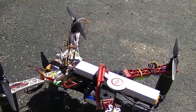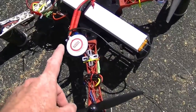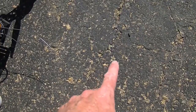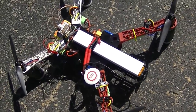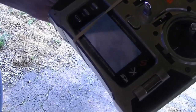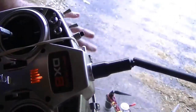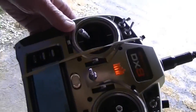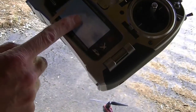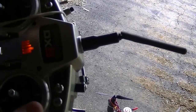The antenna is mounted underneath - that was another suggestion - and that seems to work pretty good. We've got eight satellites. In closing, I tried moving the GPS way out, a couple of feet away from the antenna, and it didn't seem to help. The radio is on range check now for the final step - I just need to see if the receiver still works with all this 1280 gear on, making sure it's not interfering with the RC receiver. I'll use a rubber band to hold the range-check button down.